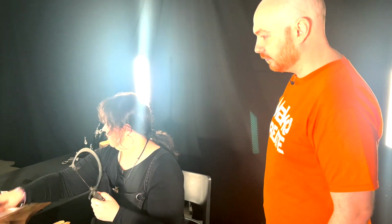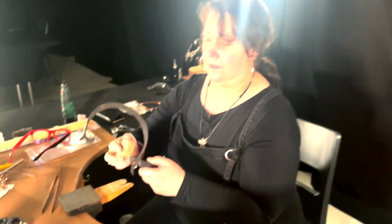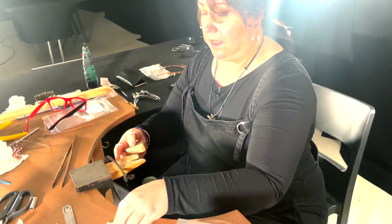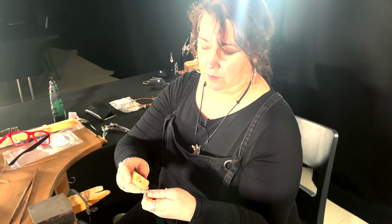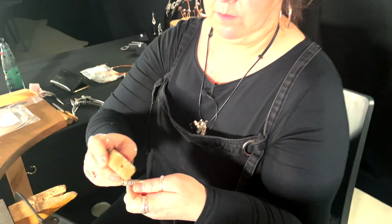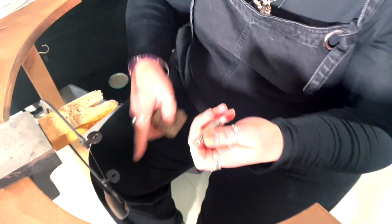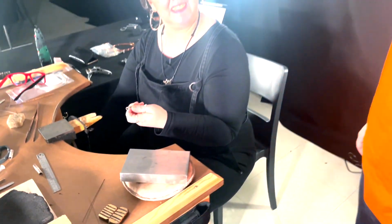Brilliant. And the first thing we need is some lubrication on the saw blade. And is that wax? It is just beeswax. Natural beeswax. There's all sorts of fancy things. I'm going to put a little bit on here as well, which just helps. Some people do, some people don't. Some people put it up the front of the blade, but I don't like it because I find it clogs the teeth. So I always like to put it up the back of my blade.